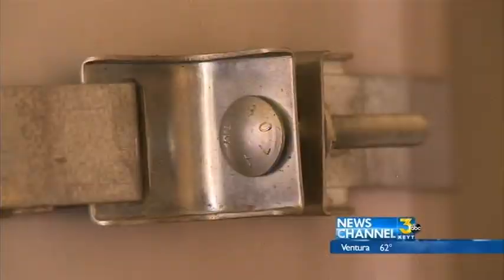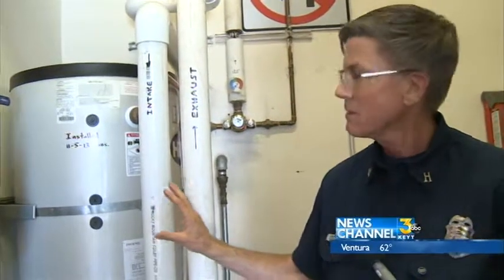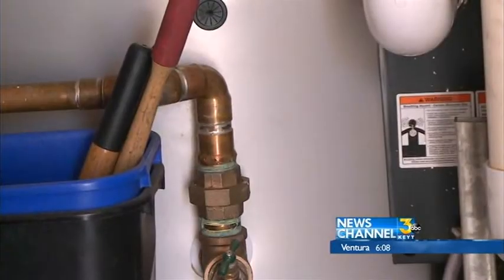The concern is that if your water heater isn't strapped, it will fall over in an earthquake. Associated with that water heater coming loose would be unsecured utility lines — gas lines in general around here. A lot of times there are also electrical connections with water heaters.